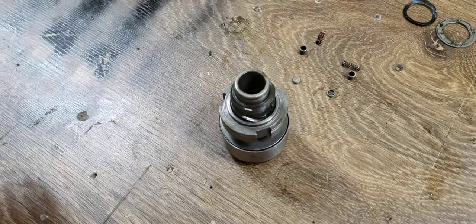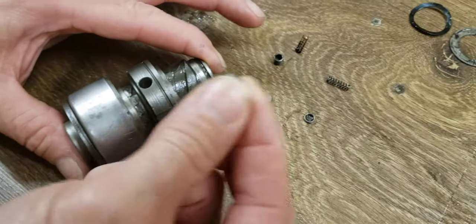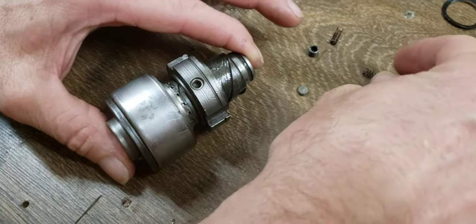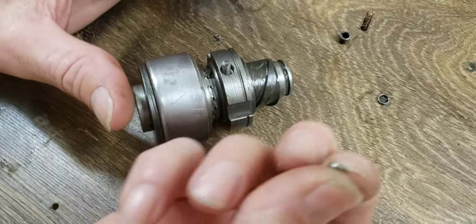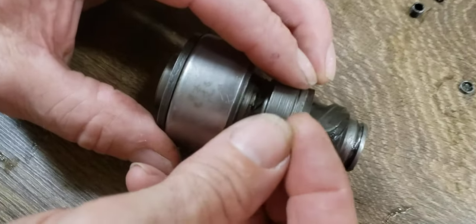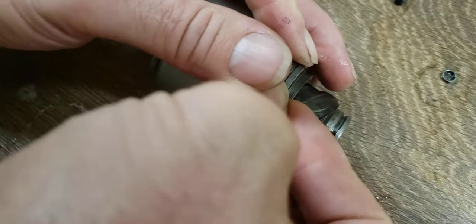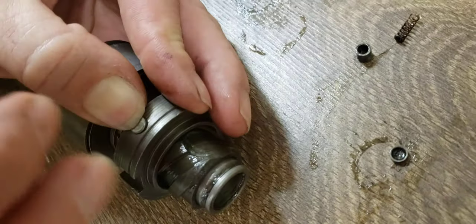I'm going to take my gloves off. That's one of the plungers — it goes in there just like so. And the spring goes in there. Now you don't want these to fling all over the place — my son and I have spent an hour looking for them. That's kind of like a freeze plug right there, the real small one. So we're going to take that, push it right here as hard as we can and kind of lodge it down in there. Hold it with our fingernail and give it a little tap — we do not want that taking off on us.